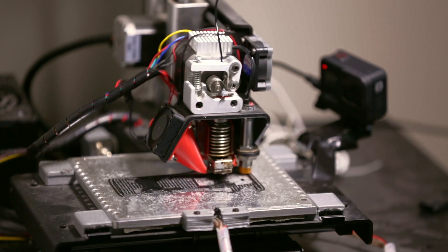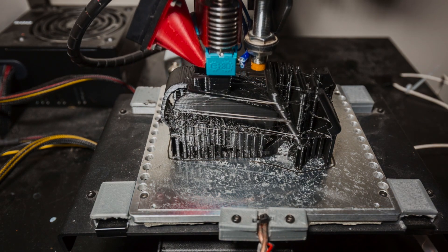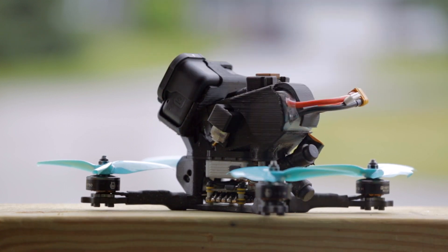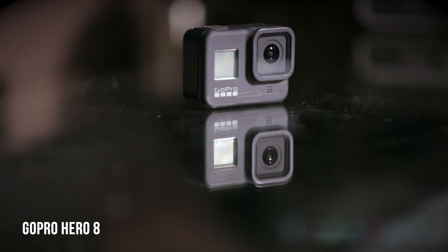The other unique feature in my drone, which is pretty cool — we actually did a video about it — is my 3D printed backpack. Everything above the drone is one solid 3D printed part that I designed and had printed with my buddy Alex. It holds three things really well: my batteries without battery straps, a place for my GPS to fit without getting ripped off flying through brush, and my beeper is strongly secured. All three of those parts fit really nicely into the backpack. Out front, I fly with a GoPro Hero at a 30-degree angle right now. I'm going to build a second mount at 15 degrees so I'm not always flying as fast, and switching out backpacks will be super easy.